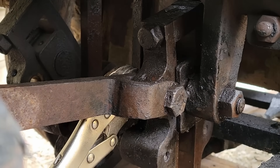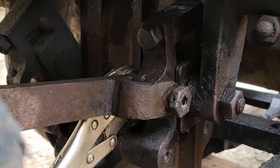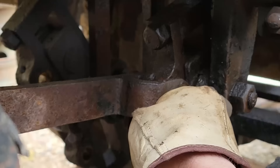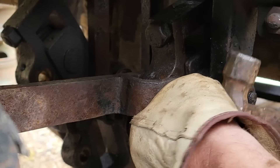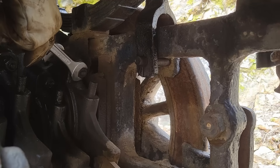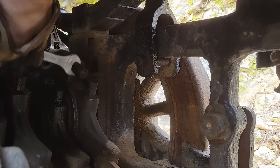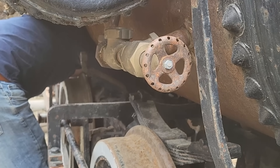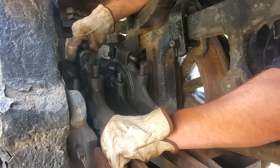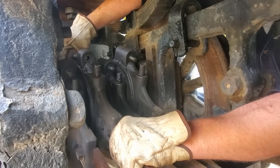If you look close, you can see the links are made out of four pieces held together with two bolts. When you're hammer-testing an engine like this, it's very important to always check these bolts for tightness. Working between the boiler and the frame made the upper eccentric bolts somewhat easier to access compared to the other valve gear parts. The nice thing about such a small locomotive is that no matter how awkward something is to access, it's never more than arm's length away. The eccentric straps are now carefully taken apart, being ever cautious not to drop or lose any of their shims. This was all done by feel, as I couldn't see anything while I was doing it.